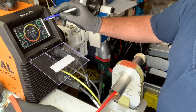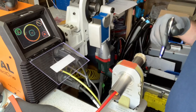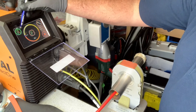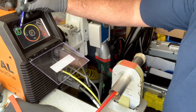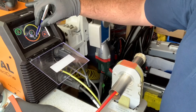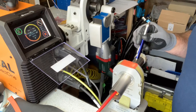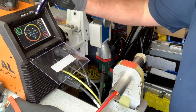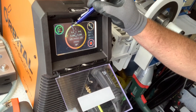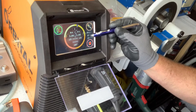Press the green button to weld. The purge is flowing — you can feel that. The motor is homing. The weld head flow shows about 15 to 16 here. It's now purging for 30 seconds and once that's finished it will strike the arc. Arc is struck — now welding around. You'll see on the screen the actual position of the weld. It beeps at every level change, so it's now on level two.